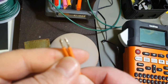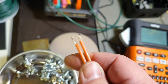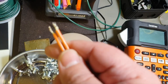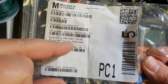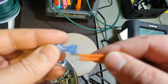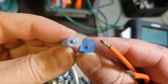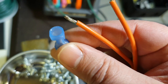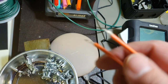Look, you have two gauge 16 cables, 1.5. You want to combine them, and obviously you can't use the red one, but for the blue one, for example, I have this from TE, which says 1614. It has enough room for insulation of two cables, but look at the hole and compare, for example, with the Swedish one I have here. Here is no room for two insulated cables. And yeah, that's taken into consideration. Probably another model will have it.